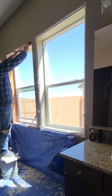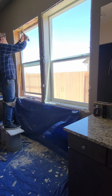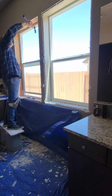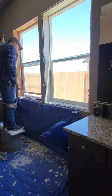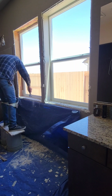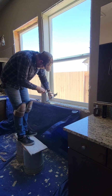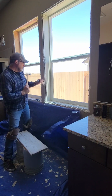In some spots, the sheetrockers put some extra plywood in so that they could bring, again, the reveal better around the window. At this part on the top, it really wasn't interfering. Once I got the measurements of the jamb put in there, it wasn't going to keep it any less. So I was able to keep the reveal around the windows. So I didn't really worry about tearing out all of the plywood that was added extra.